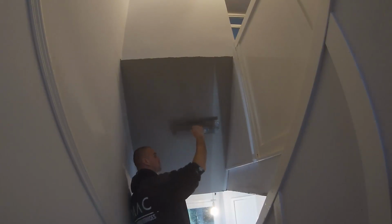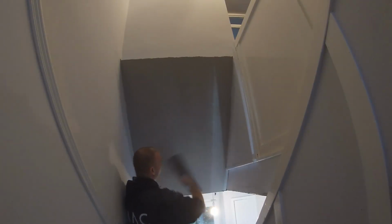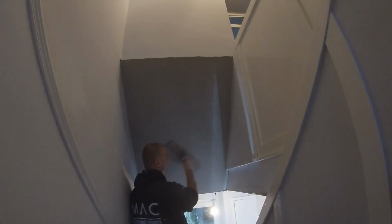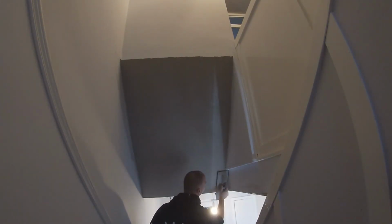Sometimes it will be important just to run the trowel down the middle of these two, guys, because if you keep troweling like that, you can create that bit of a bump, similar to what I was talking about at the beads. Although here, sometimes you don't have much of a choice either. You'll have to weigh up your options, guys, what's going to be best.